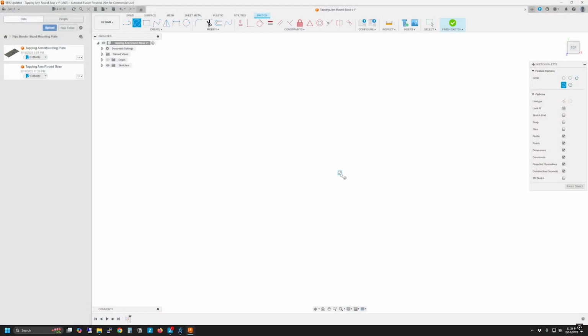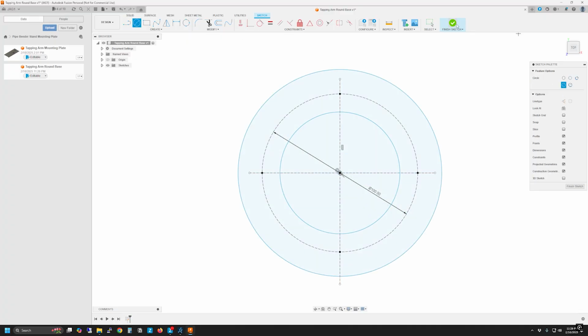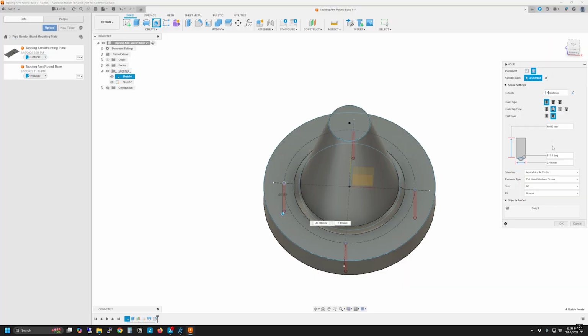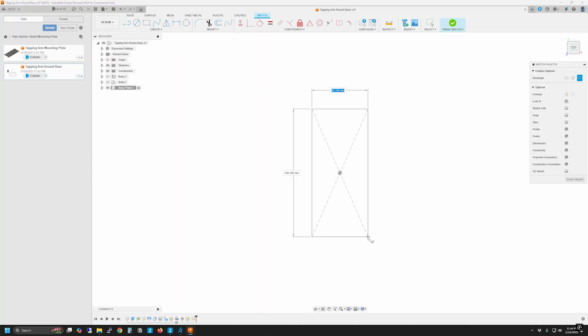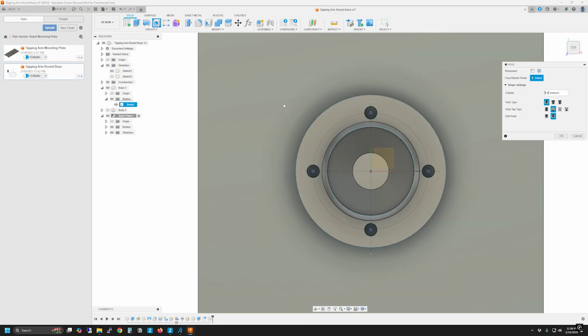The last issue I had was that the screws I had on hand to attach the mount to the base plate were a bit too long. Buying different screws would take time. I could cut down the length of the current screws, but that's messy and then I'd have to clean up the threads. So what to do? Back into Fusion to design some countersunk washers that would fit the current screws I have, raising them just enough to be able to fully tighten without protruding past the bottom of the plate.